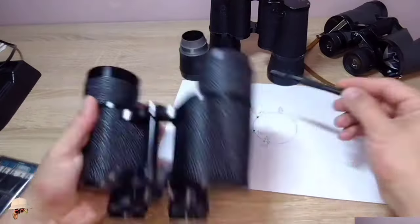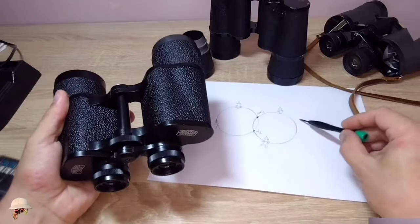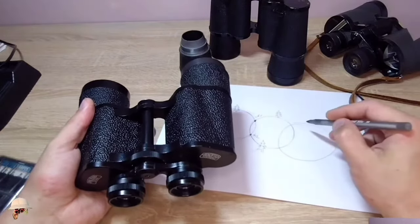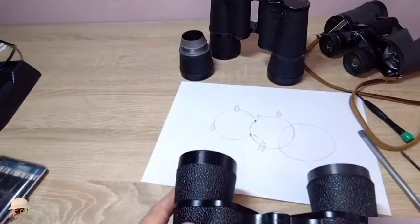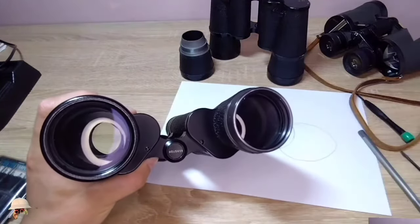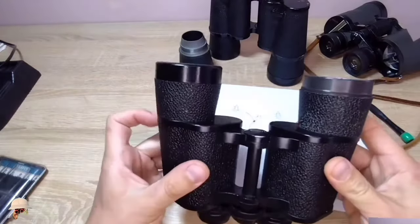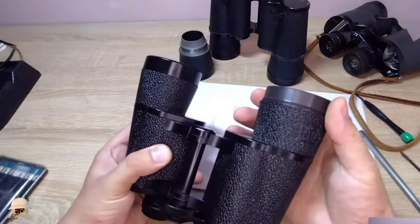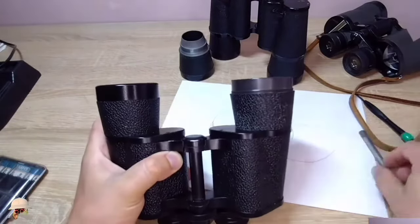Then you take the left image and scroll it as well, so that it aligns precisely with the right. Occasionally, following deformation from an impact, you find yourself unable to combine the images in any way. In that case, you already need to rely on prisms to assist yourself. The simplest and most reliable method is just to unscrew the lens here and screw it back in. There have been occasions when binoculars were sent to me for repair causing double vision — and all because the pipe had gotten a little loose, coming out of the thread. Simply unscrewing and screwing it back in finished the repair. Afterward, check that there are no gaps in these areas.